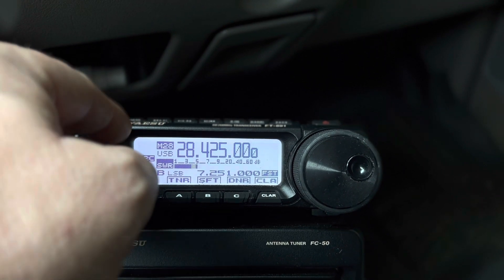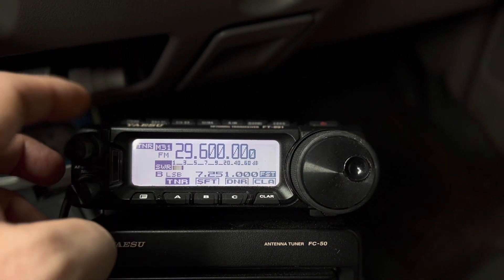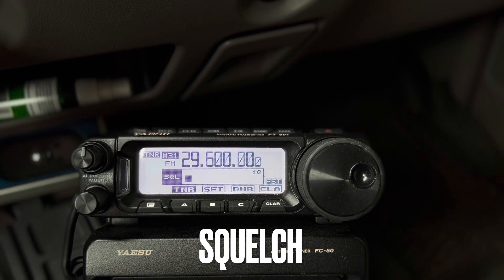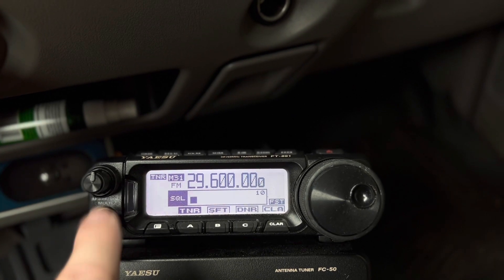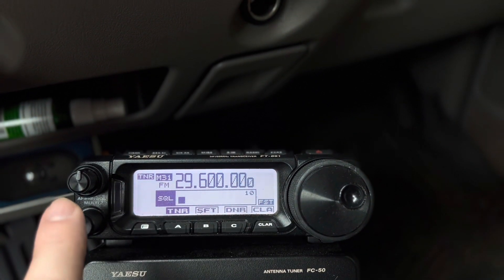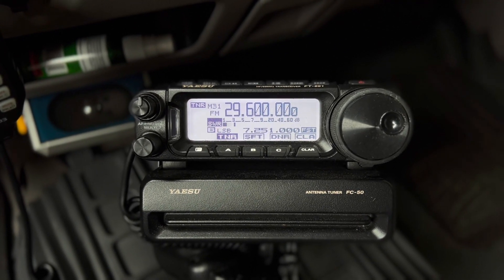See how it's masking the background noise. If you're having a QSO with somebody who's 20 over, you don't need this between syllables. But watch this — I'm going to go up to the FM and notice we get no background noise, because that knob just became a squelch automatically. It knows FM — you're going to need a squelch. If you turn that ring to set the squelch, it'll stay and show you the squelch setting. Press your multi-knob to make that go away. There's a bonus for those of you who watched all the way to the end.